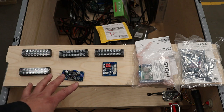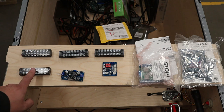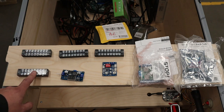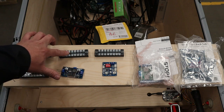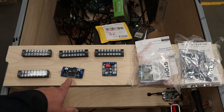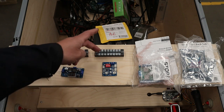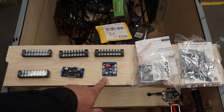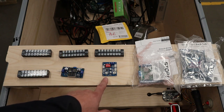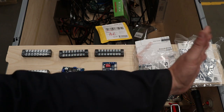Now, I was thinking that this could be 0 volts, so this could be our common and our grounds block. This could be 5 volts for things like LEDs, adjustable LEDs, things like that. This one will be 6.3, a stepped down voltage from 12 volts with this step down regulator. This is going to be for some of the buttons like the coin door and the launch button. And then this one here is going to be 12 volts. And since this pulse width modulated fan board operates off 12 volts, I figured I would mount it there as well. And then I'm left with this empty space.